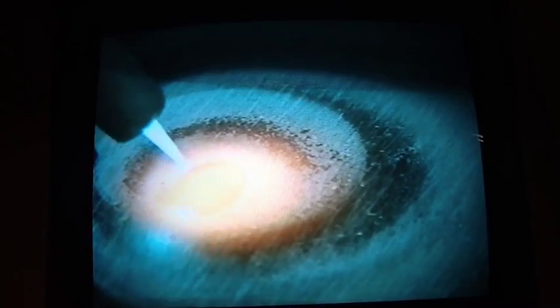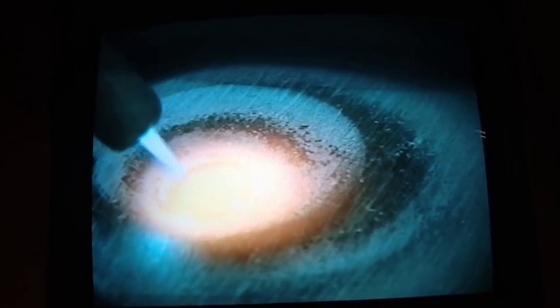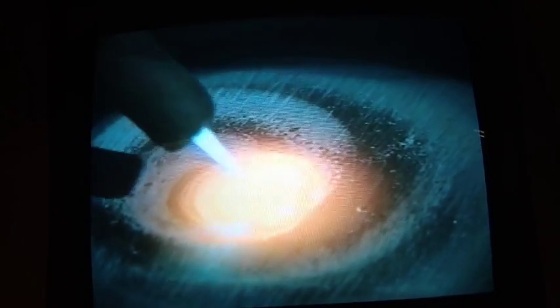Here you're looking at a close-up of the puddle. You can see a small liquid puddle that's a quarter to five-sixteenths inch in diameter. Small little circles being done each time I come around. I'm moving the puddle forward with the torch a small amount, keeping the cone an eighth inch off the metal.